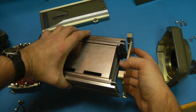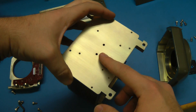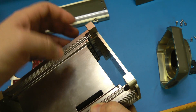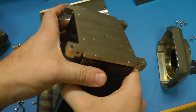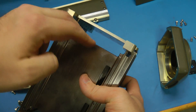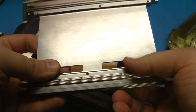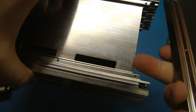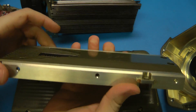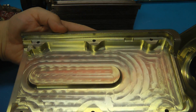The image sensor would have mounted on to this card and slots into here. I'm not sure if this camera had a thermoelectric cooler or Peltier device to cool the image sensor — I know some of the newer ones do. This one doesn't seem to have enough heatsinking for that, and they didn't pay attention to thermal coupling from this to the side heatsink, so I don't think it did. There are board-to-board connectors that connect between the cards through these holes. As usual on something this expensive, the machining is really really nice — almost certainly machined out of blocks of solid aluminum — and the machining marks are quite beautiful.